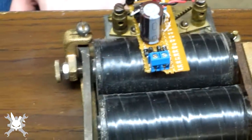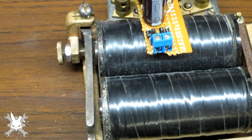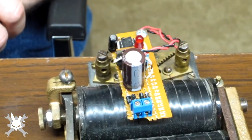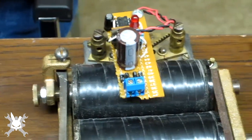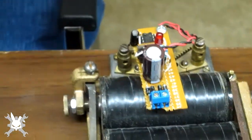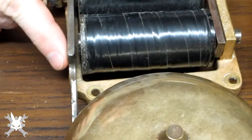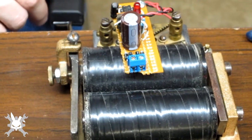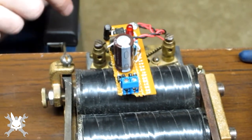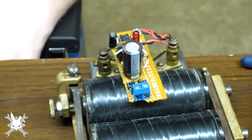Very cool. And what's this? What are these two spools? Magnets? Yeah, that's the magnets from the bell. It doesn't seem that secure. They have to suck in, it's like an electromagnet. Yes. Mechanical bell. I get it now. Very nice. Most bells have an interrupter switch, so when it pulls in, it automatically releases. This was a sounder bell for telegraph type stuff. Oh, neat. So it never had the ringy part. You apply power, it sucks in and holds until you let go. Very nice. Very cool. Good job.